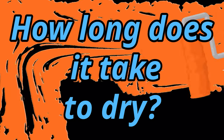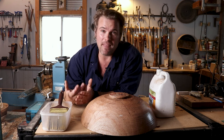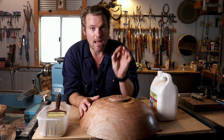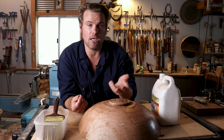How long should it take for blanks to dry? There's a rule that says one year per inch, but that doesn't hold across the globe. Here in Queensland, Australia, one inch of timber dries in four to six months depending on the time of year. I try to harvest and dry blanks through the winter into summer so they're not as stressed. Monitor and record — go out every couple of weeks to check how the blanks are going, and that'll give you a much better idea of how it works in your specific area.